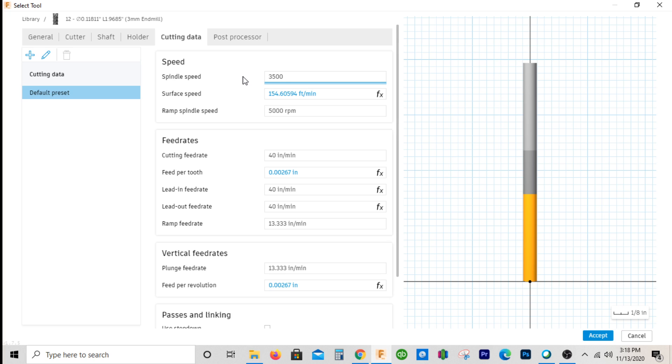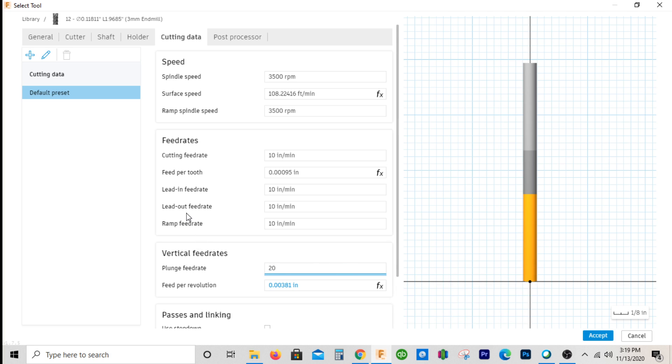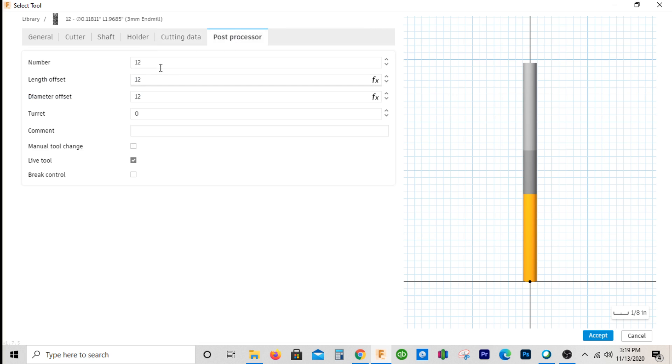Because my mill has a max RPM of 4,000, you don't want to go the maximum RPM all the time — it's just not good for the spindle. I always drop it down about 500 from max. It's like your car — you don't want to red-line it. Cutting feed rate: it's a little end mill, so we're going to go slow — 10 inches a minute. On the plunge of an end mill, you're usually not cutting anything, so I go faster since you're more feeding to position to start cutting. We'll make this tool 7.